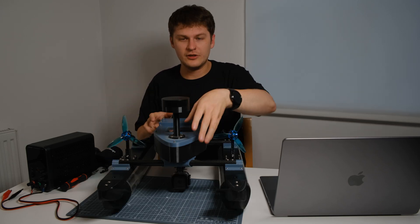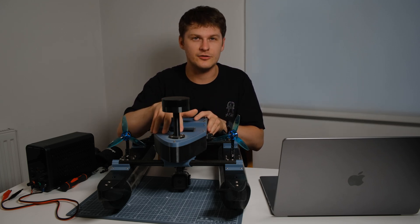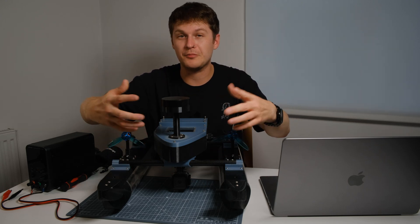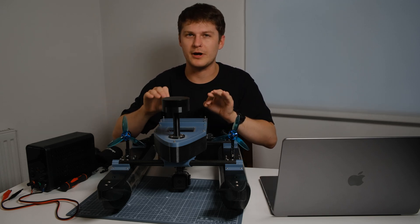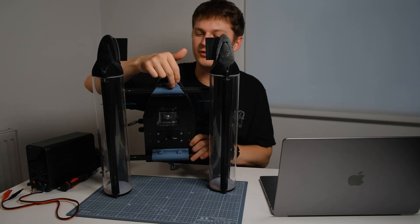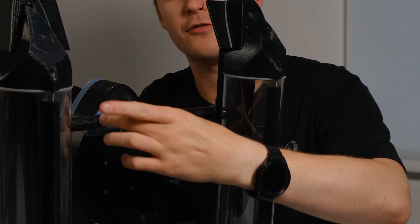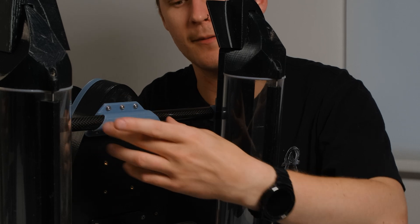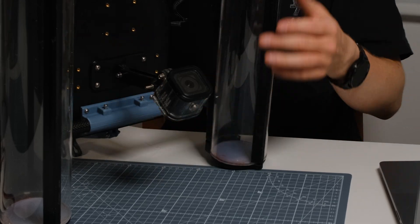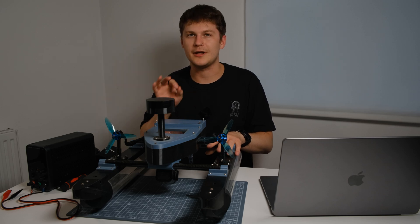The next thing is the mount. This whole box houses all of the electronics and you don't technically need it for the boat to be a sound structure. I've slightly over-engineered it, but in my defense it's a very cheap way to have quite strong structural bars — these are real carbon fiber tubes. Underneath you've got 3D printed mounts: one is press-fit and free-floating, and down here two screws go into the carbon fiber to hold it in position. I tend to only 3D print in PETG.